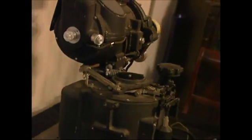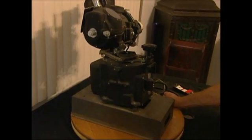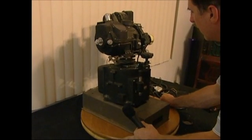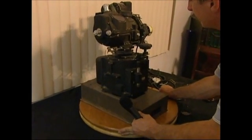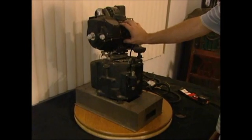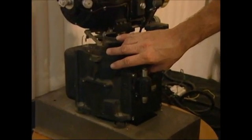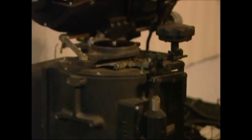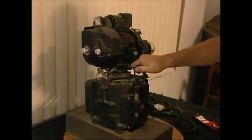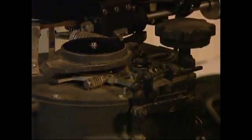One of the really cool things about this — once it's up to speed you can kind of rotate the base. That gyro in there keeps it pretty well stabilized so your head will stay straight on target. The gyro in here was coupled to the rudder control on the C1 autopilot. It's what literally steered the aircraft. And when the autopilot was engaged you could get steering control of the aircraft through this knob here.